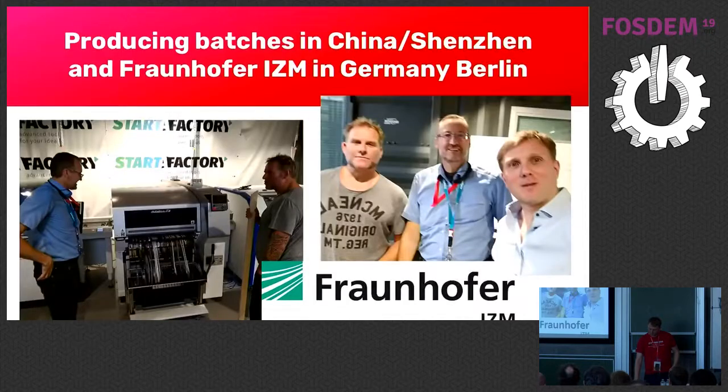We wanted to talk more about production in this session. Production is not easy. How many here have experience with production? Creating a BOM and coordinating with producers is a full-time job — it can really keep you busy. There are parts in reels and tubes and prices are different. When we checked out prices, for example for a chip, the difference can be one dollar — and that means $1,000 when you produce a batch of 1,000 devices.